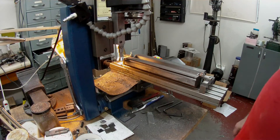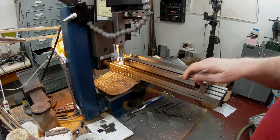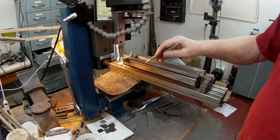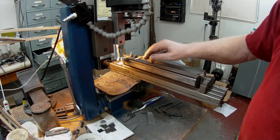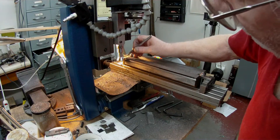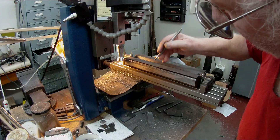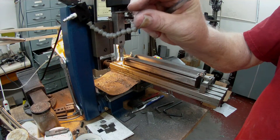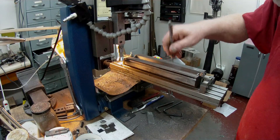I took 20 thou cuts and then it started getting kind of heavy. So I then moved the Z axis up and took a cut up. I moved it up 0.2 in height and touched on the surface and came in. And I've actually got my position at the top of the dovetail so that I've got a very slight, maybe 20 thou flat surface before the actual 60 degree goes down.